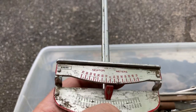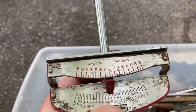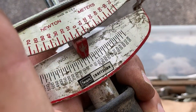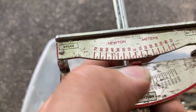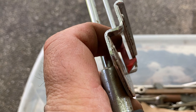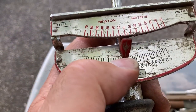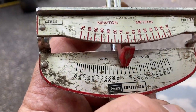If I use a click type — set it at 20 and go to move it, it's just gonna click. Set it at 30 and it may never click. What I have with the beam type is a really accurate mode with a dial on it. If you're going down to 20 inch pounds for turning torque, I would use the dial type. If you need something with turning torque and inch pounds at around 100, these are fine — you just have to make sure that pointer is not dragging. You can put a drop of oil underneath the pointer and it won't tick and skip.